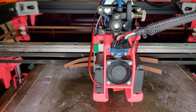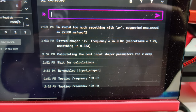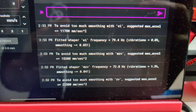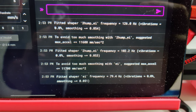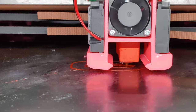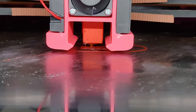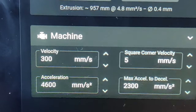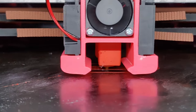The results will lay out recommended accelerations, which you can usually start with the second or third option from the top. But if you're unsure, you can run an acceleration test with the input shaping tower model, which I'll link below — this will give you an idea of what accelerations work best for your printer. Just keep in mind that as you go to faster speeds, you will need to increase your nozzle temperature to keep up with the flow, and the limiting factors will mainly be how fast your printer can push and melt filament through your nozzle.